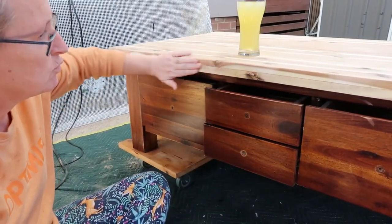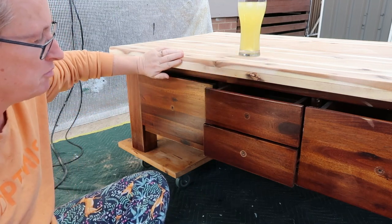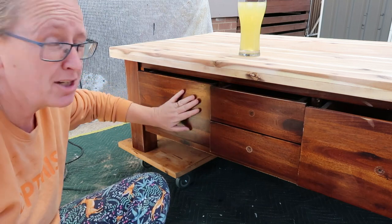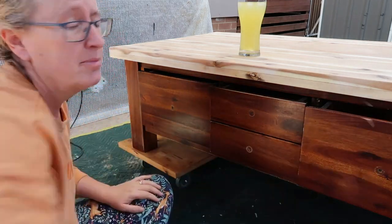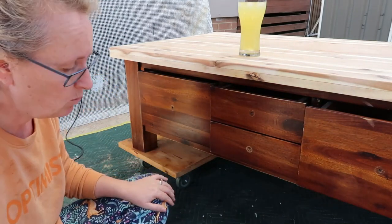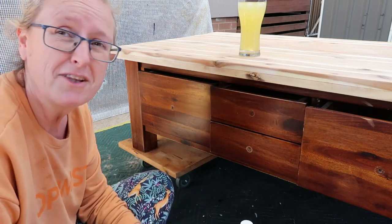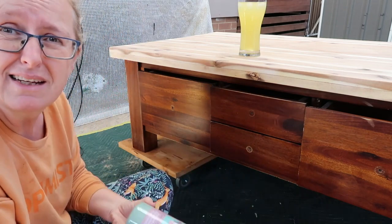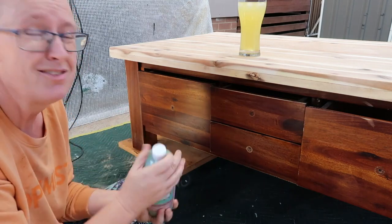The top is sanded back to raw — it's beautiful. I knew it would be beautiful. I've scuff sanded it all over with a 120 grit and I've cleaned it with Dixie Belle White Lightning. Then I've rinsed it off with clean water to get off any residue from the White Lightning. The reason for that is the White Lightning is also a deglosser, so it leaves a little bit of a residue — just clean that off.